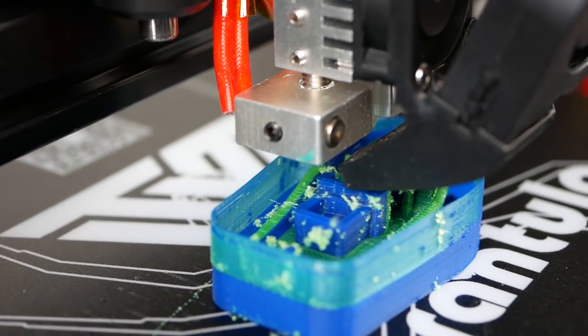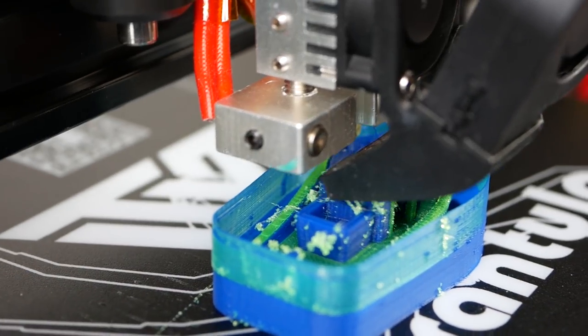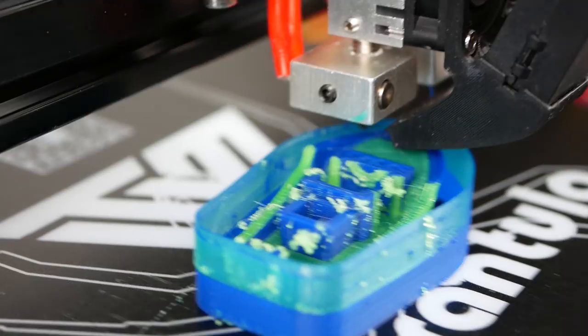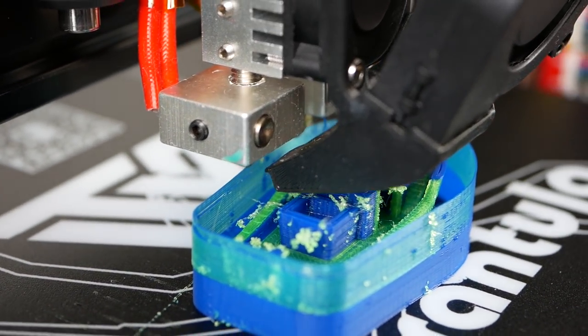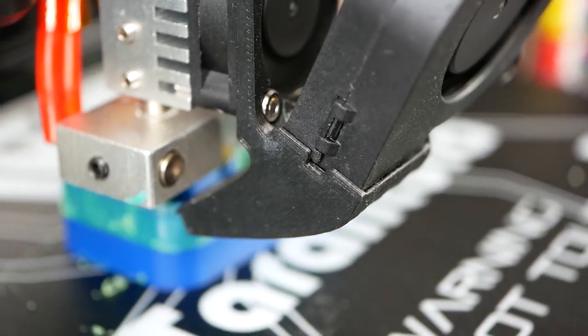Using dual extrusion with a Chimera hotend is not the most simple thing, and if you are mostly printing with a single nozzle, it can even cause printing quality issues because the idle nozzle can rub over the already printed surface and leave marks on the perimeter. In order to set up, there are two things that you need to make sure of.